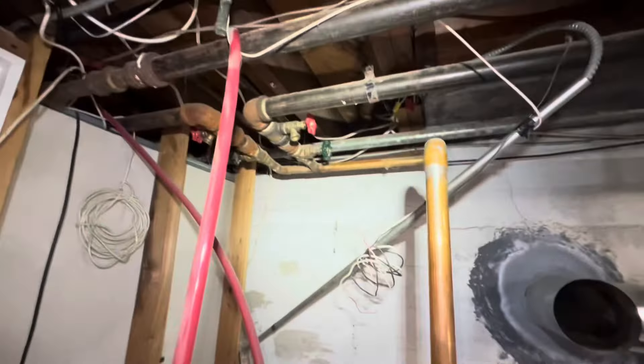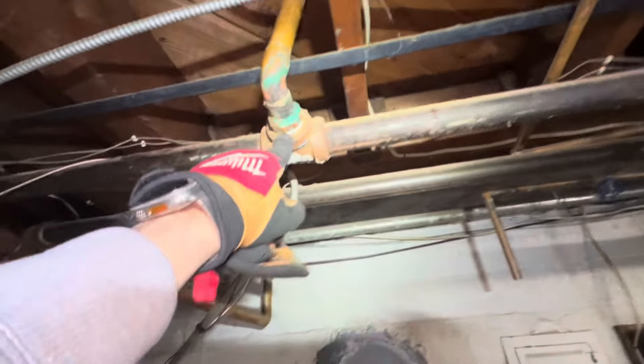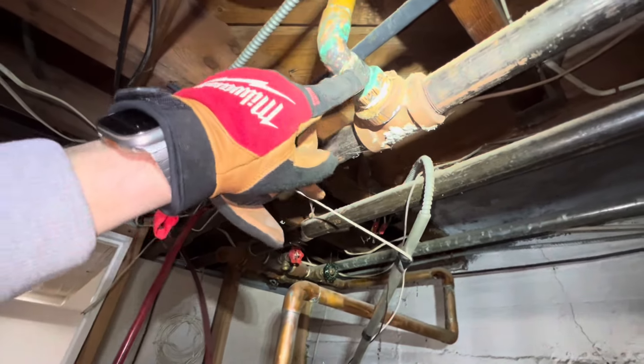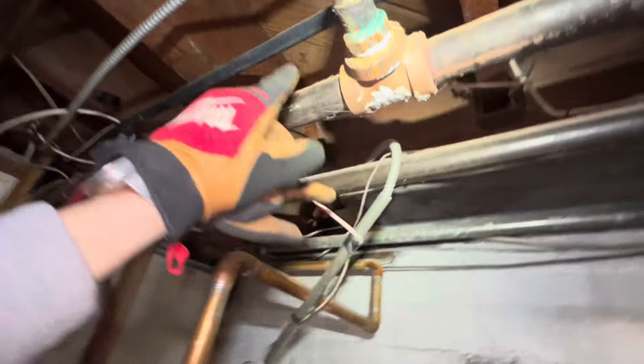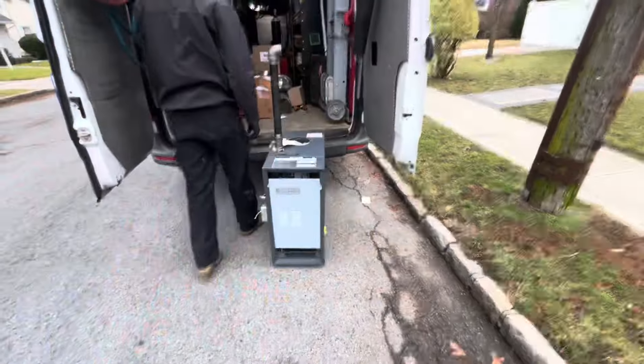We have our return line right here, which splits off. And then we have our supply line right here — thankfully I was able to spin this out because we've got a lot of corrosion here. Didn't want to risk reusing that. Peter was able to loosen that; I wasn't. It's turned up right now just because there's some water in the line. So that'll be really nice — we'll get a new press coupling in there, maybe even a black 90 or whatever we need to do to get to where we need to be. And here's the boiler.